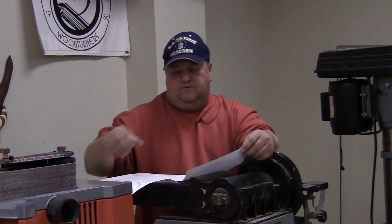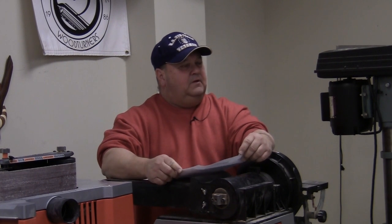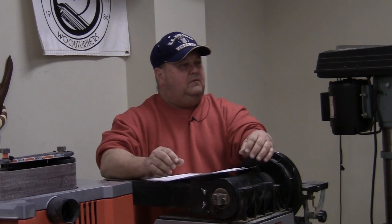One of the first things you're going to do is select your wood. For any of the ones in that first book, you need wood boards that are about 6 or 7 inches wide and no more than 53 inches. So 53 inches worth of wood you can cut up to make any bandsaw box that's in there. Now you're better off using hardwoods and not something that really chips out bad. I've made them out of wenge and stuff like that, and you get all the splintering, so they're harder to use.